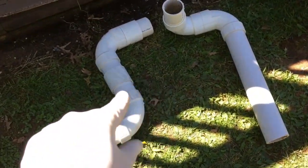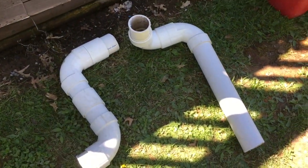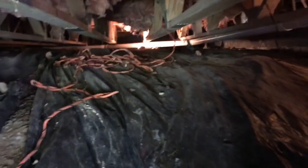I'm feeling pretty stoked. I just came out of the crawl space and reworked all that pipe in there. Here's what we removed: four 90s. And we replaced them — got the same thing accomplished with two 45s. Without getting too technical and mathematical, let's just round that up to a 'buttload' of airflow that we have salvaged.